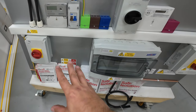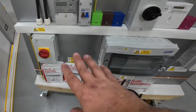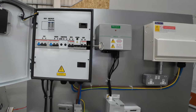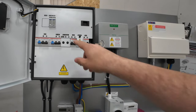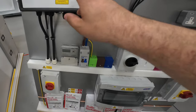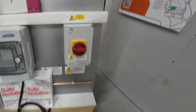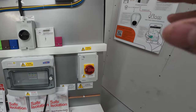We've got our battery warning label. We could in the future add an AC coupled battery if we wish, but for the minute we're not doing that. I've got concerns around safety — lithium batteries inside and all the rest of that stuff, plus any access to live electrical systems when you've got regular consumers wandering about is something I'm not quite comfortable with. We also have the PV side here, so we can drop out of the PV isolator, MCB-RCD, as you can see tied together up here. It drops down and runs across into this M2 AC isolator over on the right-hand side, and you could connect in a PV inverter if we wish. All of the connections and everything are there waiting for that.